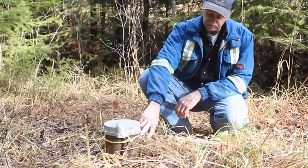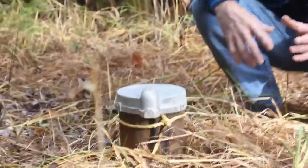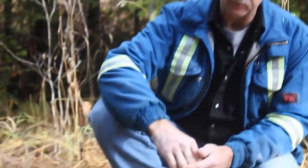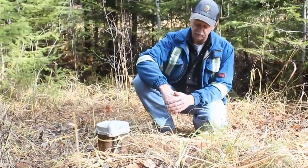This rope is what is used to put a liner in the well. When they drill the well, if it's a bedrock well — which this one is — they will put a PVC four-inch liner on the inside of it. That's just because they drill open a hole and it keeps the bore wall from collapsing on top of your pump.